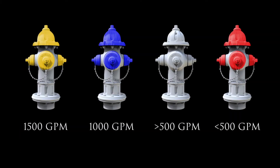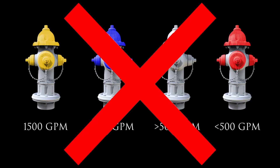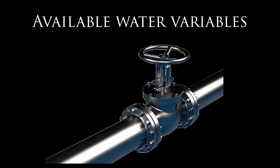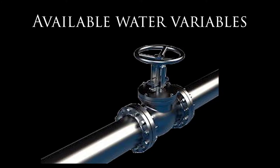It has long been the understanding in Dallas Fire Rescue that the color of the hydrant top can help identify the minimum amount of water supplied by that specific hydrant. After reviewing 5 years of historical flow testing data from over 1,600 fire hydrants across the entire city, we have found that available flows from all categories of fire hydrants actually have a rather significant range. It's important to understand that while the size of the main does factor into available water, other factors play a much more significant role.